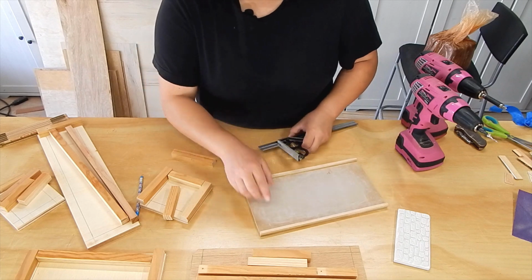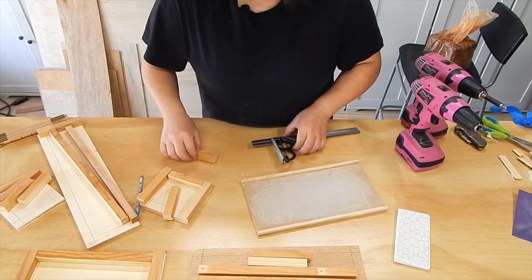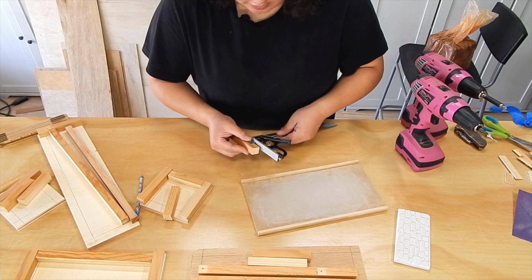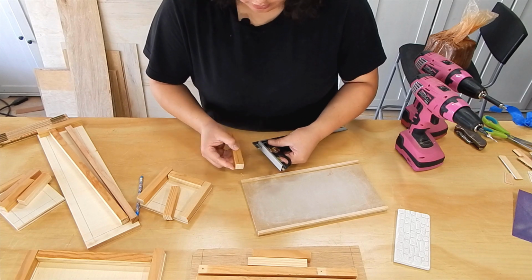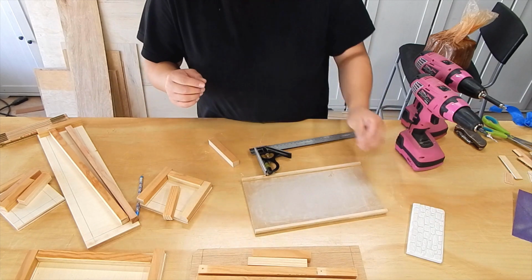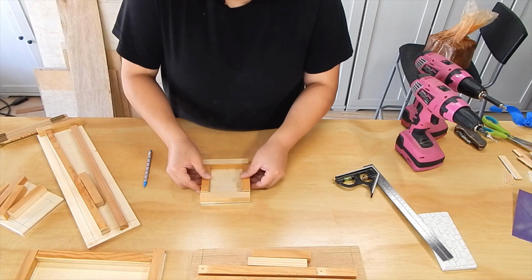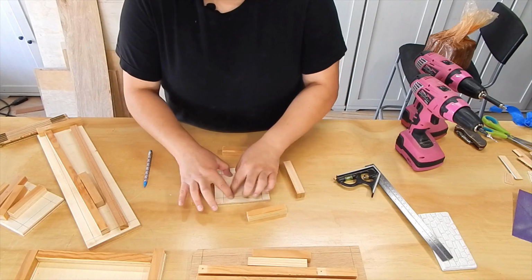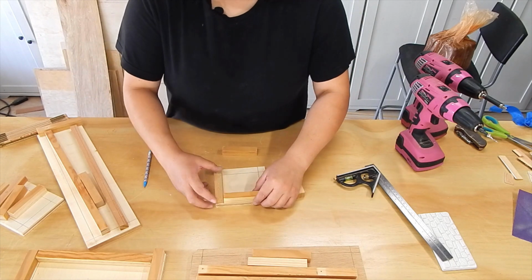So I had to account for the 1/4 inch thickness of my slab, and then determine how wide I wanted that to be, and I ended up going with 7/16, just a 16th under 1/2 inch, so that I'll have this brick protruding and then a little plate for it to get glued down to. Once you have your lines marked out, you can begin to apply your tape. I'm just going to apply tape to the sides of the square stock, because the bottom is going to be in contact with the clay, which the cement won't stick to.